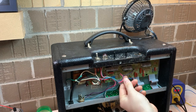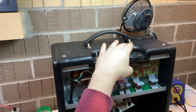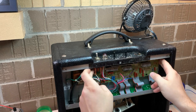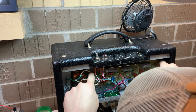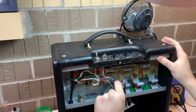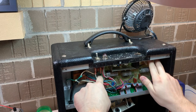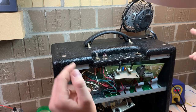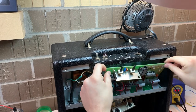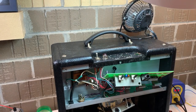There's only a handful of screws. The top right corner is a ground screw — it is very, very important that that screw gets put back in snugly. You gotta be careful with this. The Pro Junior's not that bad, but the Blues Junior can be real stressful. You do not want to flex the circuit board when you're pulling it down — you just want to pop it out. Don't pull any wires. Sometimes you have to pull that pilot light wire out, but in this case I didn't have to.